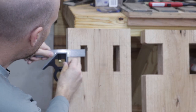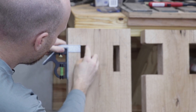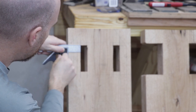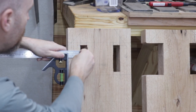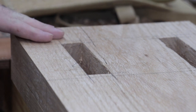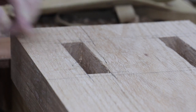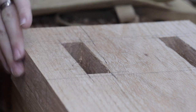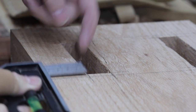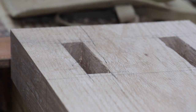What I did was I took my combination square, lined it up with each mark on the joint, and tightened that down. Then I can take this over to my other upright and mark each line. I've secured my combination square with the mark taken on the number three upright, and then I came along the reference edge of the board and marked that line.